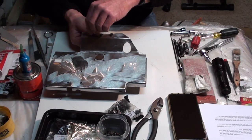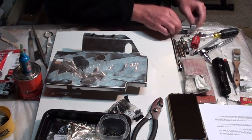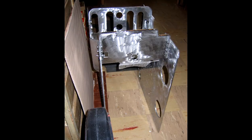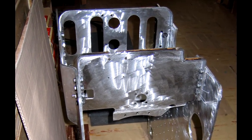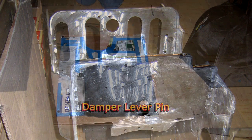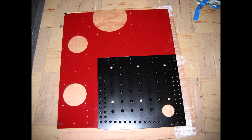Although there are really not many parts to fit, we still loosely bolted the two spectacle plates to the two horn plates. We also checked alignment of the belly tank brackets to their holes, although we did not fasten them to make painting easier. The damper lever pin is fitted on the left side in the series of four vertical holes that secure the rear spectacle plate to the left horn plate. It must be fitted in the third hole from the top.